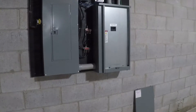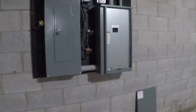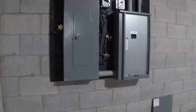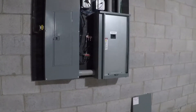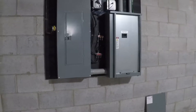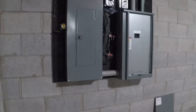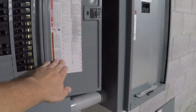That's one of the major advantages to this system compared to something like a manual transfer switch with a portable generator. Not only is this system 100% automated, but I didn't have to do a sub-panel and pick and choose which circuits to go with. This will comfortably power the entire house even with the air conditioner running — I've had extended power outages in hot weather with the AC running, lights on, TV on, all systems working perfectly fine.